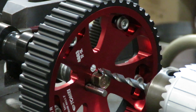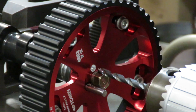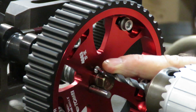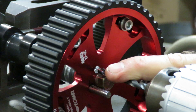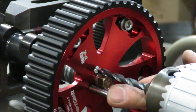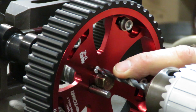We've set everything to zero on the X — the X which is the vertical — and the Y, and we bring it in and out on the Z in this particular case on this machine. The battery's running very low, but we're going to drill this two tenths of a millimetre undersize and then go up to the full size, and we should be able to offer up that pin in a perfect situation. We'll run it down two tenths less first. Looks like our battery's gone.